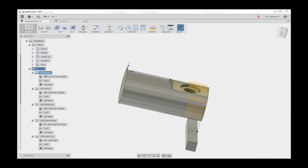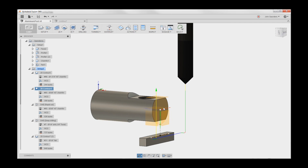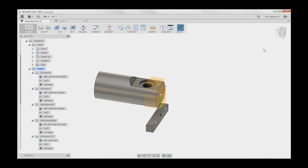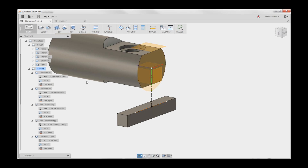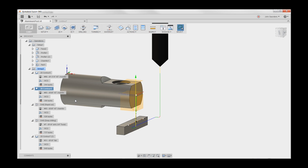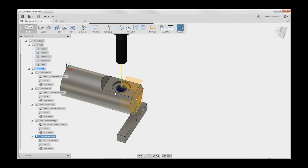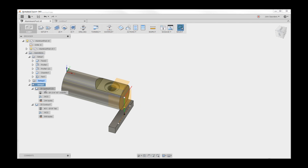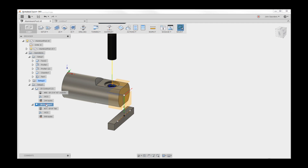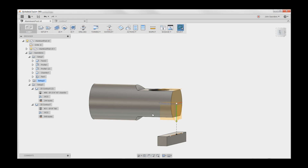When we come into the mill CAM, we've got our tool modeled up and we're facing it off. We're doing a 2D contour on that front face — the best way I found was to add a piece of material down here, which lets me drive the height of my tool to cut at the correct level. There probably is a better way, but that's how I did it. Spot it, drill it, 2D contour that pocket to interpolate the countersink. For the third setup, I duplicated that operation and deleted everything except the face and the countersink — because we flip the part but it's symmetric, so I didn't even need to model the bottom side originally.